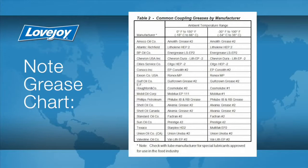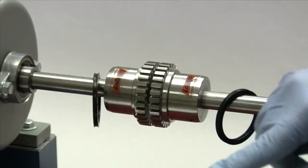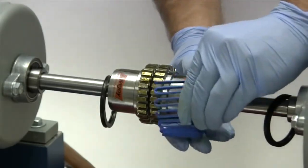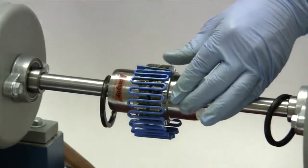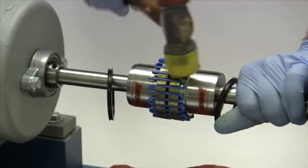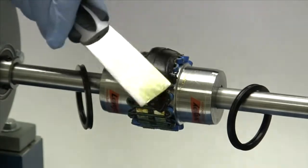Grease is provided with coupling sizes 1020 through 1090. To install the grid spring, rotate the hubs so the teeth of the hubs are in line, then smear a light coat of coupling grease around the teeth on the hubs. Carefully wrap the grid spring around the hubs, lining up the grids with the hub teeth. The grid spring will need to be stretched slightly and nudged into the slots using a flat blade screwdriver, finishing with a soft faced hammer. A regular steel faced hammer will damage the grid spring and possibly the teeth on the hubs and should not be used. When the grid spring is completely seated, take a putty knife, preferably one with a soft blade, and smear the remaining grease around the outside of the grid spring.